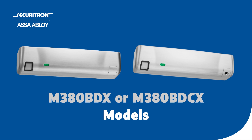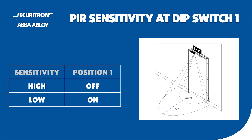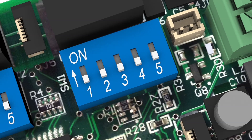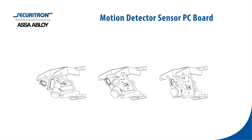If installing a motion detector equipped model, set the control features using DIP switch SW1. PIR sensitivity can be decreased by switching SW1 position 1 to ON. The PIR ambient light compensation feature is enabled or disabled using SW1 position 4 — to enable, set position 4 to ON. There are three positions for the motion detector in the modular bracket. To extend the zone further from the opening, position the motion detector in the middle or most upright position.